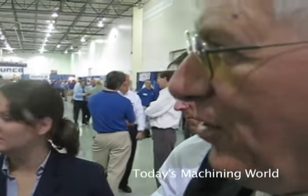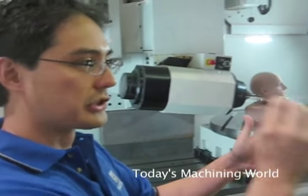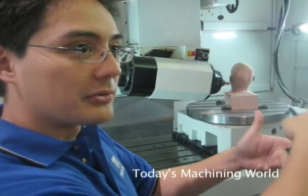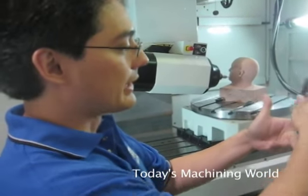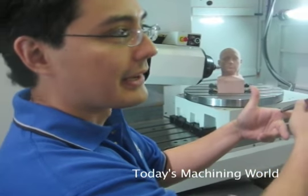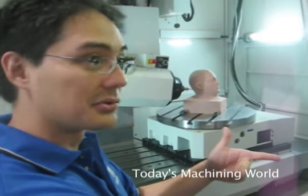You digitize it and the data goes into the program. In your CAM software, there are a lot of points that the tool is going to generate along a pass of the tool moving about the part. Those points include an XYZ point relative to your coordinate system at the top of the head. The tool also has an orientation called a tool vector with X, Y, and Z components — referred to as IJK. So each block in this program has an XYZ for the tool tip and an IJK for the tool vector direction.